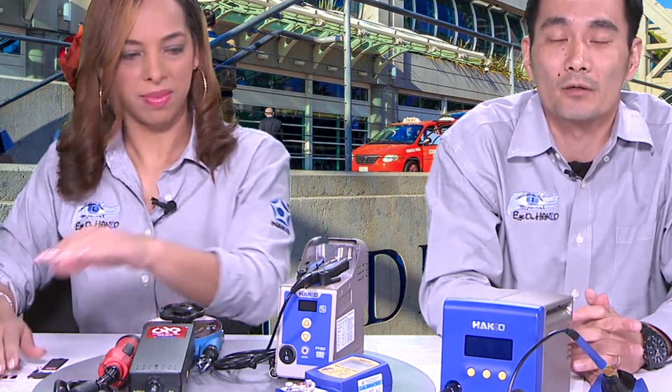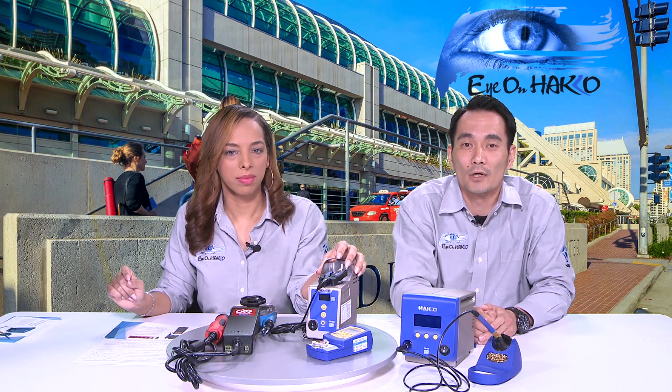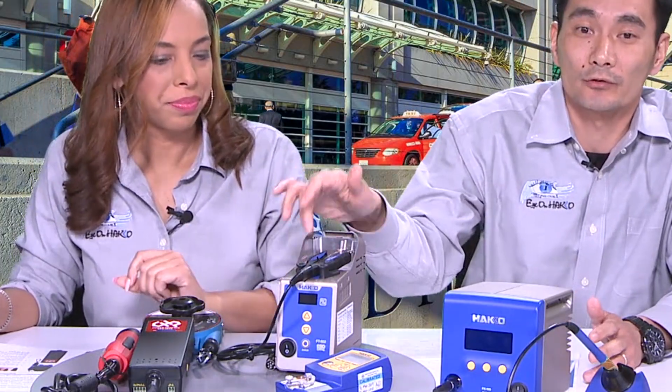Right next to the HJ4000, we'll have our FT802 thermal wire stripper — a new and improved model with better performance and improved blades for better blade alignment. The new blades are called G4 blades. We have three available: the G4-1601, a straight type, and the G4-1602 and G4-1603, which are notched versions. They cover a range from 26 gauge down to 38 gauge wire. The station has a built-in handpiece holder, shields for burn protection, and a blade removal tool built into the holder.